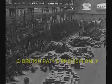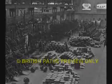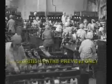So far, we have shown you cables used for heavy current. In this shop, cables for the transmission of the minute currents at low voltages used in telephony are manufactured. Telephone cables, instead of a few large conductors substantially insulated, consist of a number of small conductors, amounting in an extreme case to 2,700. These are insulated with a single wrapping of dry paper. Another type of conductor, such as those used for winding coils of dynamos and motors, is covered with cotton.